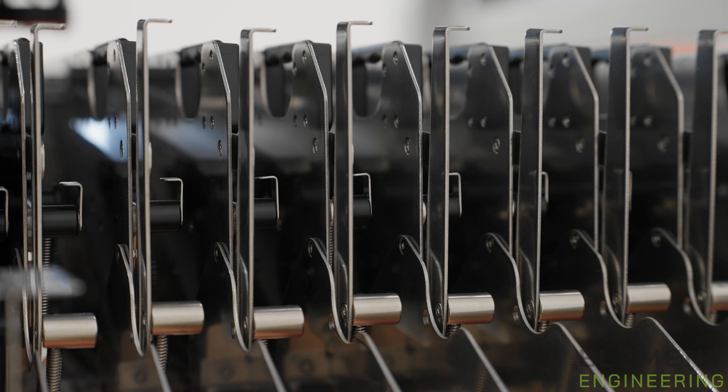Once they're calibrated we're basically running boards through — we've got boards ready to go. We're doing a consumer product for the cycling industry, which will be one of the first boards we put through. That also allows us to test a new sensor on a full production run. Boards into the stencil machine, nicely stenciled, boards into the pick-and-place machine — let's see how we go.